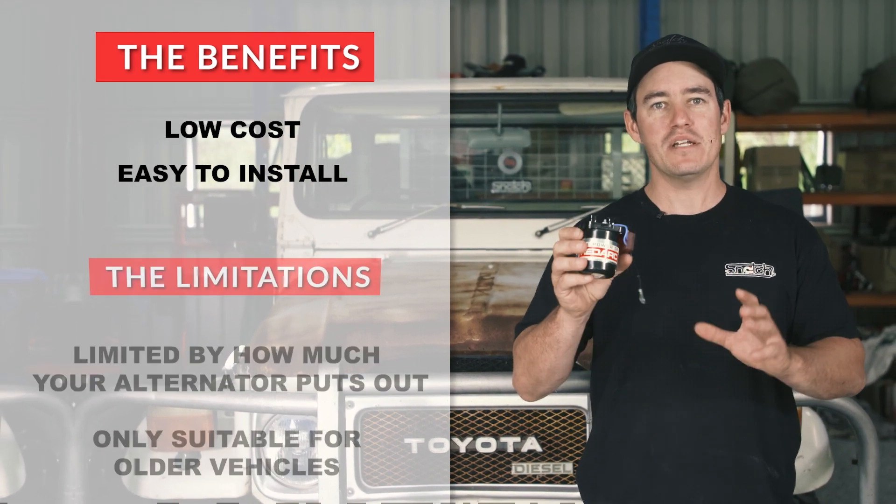Here's another limitation that a lot of you guys probably didn't know. Deep cycle batteries have a maximum amount of current and voltage that they can be charged at. I used to think, probably just like you guys, that the faster you charge a battery, the better. Well, that's not the case. Each particular battery out there has a really specific set of voltage parameters that it needs to be charged at. Most lead-acid deep cycle batteries, like your standard wet-cell or AGM batteries, can only handle a maximum of 14.6 volts and 30 amps of charge. Any more than this, and you could quite literally be cooking your battery.